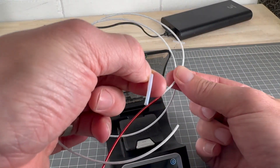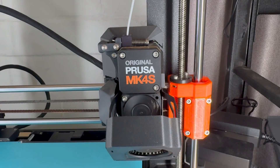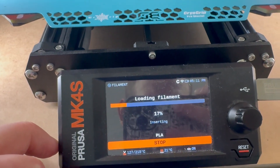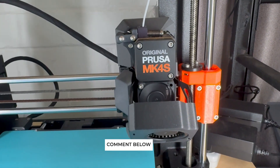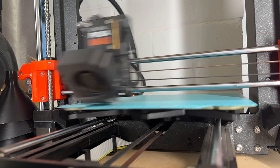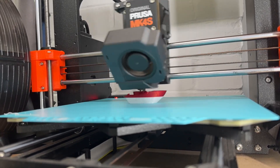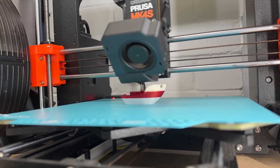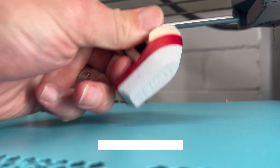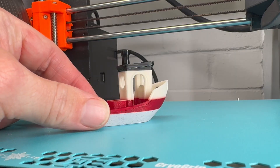Now I have a fair few colours fused — let's fire up the 3D printer. I wrapped a small amount of filament back on a spool. If you're doing heaps, I'm going to need to get a spool winder. If you have any good downloads or links, chuck that in the comments. Once the filament's fed in, I checked the exposed joints and it looked great before we started printing. The best test is the Benchy — here's a time lapse. This is four colours of PLA from three different brands: Sunlue, Prusa, and Polymaker. Links to the filament connector and extra PTFE sleeves will be in the description. The result looks amazing — no issues in the transitions between filaments, though I can see the Galaxy Red bleeding into the vanilla during multi-colour transitions.